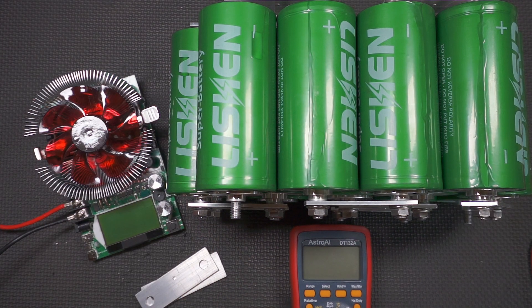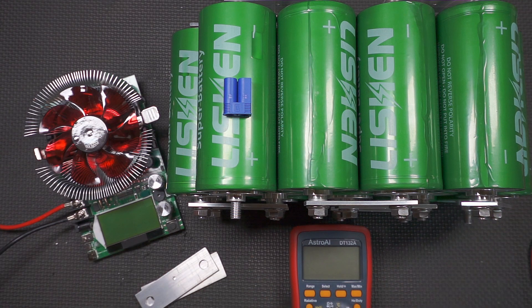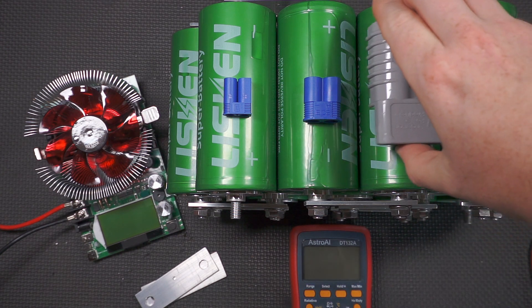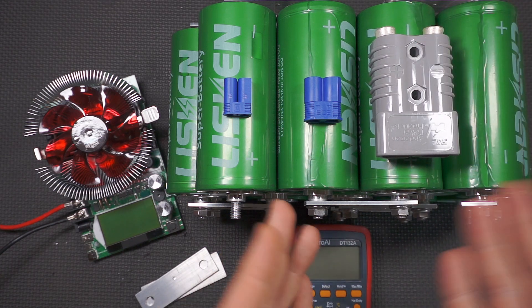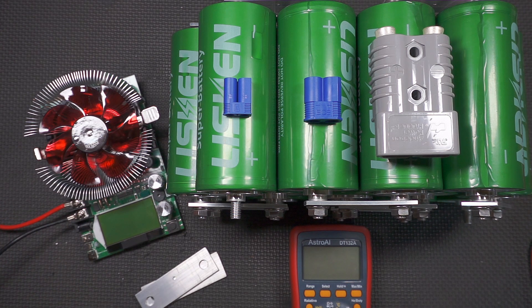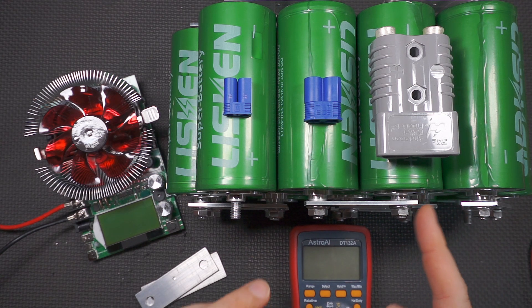It's time to step up and put on our big boy pants. This is the connector on the end of each battery pack we've been using — those LiPo RC battery packs. These are the largest connectors I've been using in the entire system: 8mm bullets. Well, it's time to start using things like EC5, EC8, and Anderson Power Pole connectors rated at 175 amps — and that's 175 amps live during the connection and disconnection process.